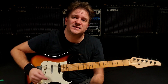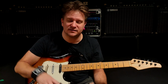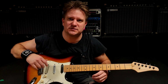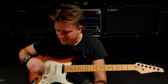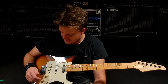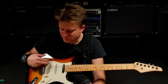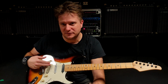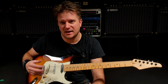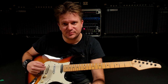Another thing is a Seymour Duncan Hot Rails pickup, which is actually a nice pickup. It's very dark in the treble area. This one is pretty dark too, not quite as much, but almost. The resistance of the Seymour Duncan is about 16 kilo ohms, which is outrageously high. This one, I think I measured about 12. And it seems, to me, like a great humbucker for the bridge.